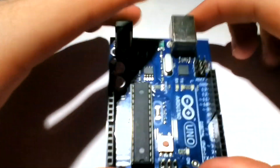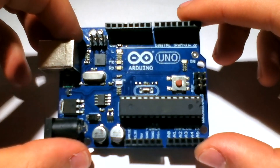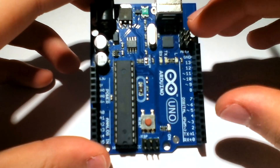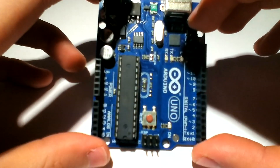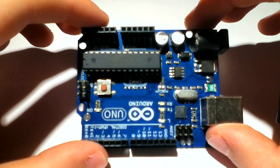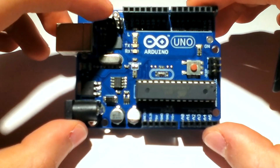Compared to the Netduino, this is an AVR microcontroller as opposed to ARM, running at 16 MHz as opposed to the Netduino's 48 MHz, so it is slower. But it has a much bigger — I'll call it a fan base, development group, hacker group — so the support on this is much greater. Another tech spec: this uses 5-volt logic as opposed to the Netduino's 3.3-volt logic, so depending on the board you're working with you might have to keep that in mind. But other than that, it's pretty much the same as the old Arduino and almost the same as the Netduino.